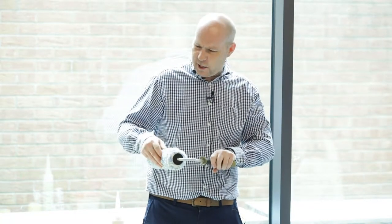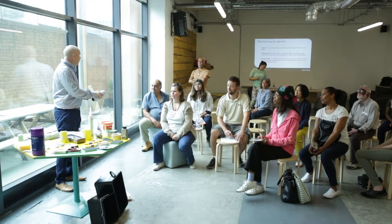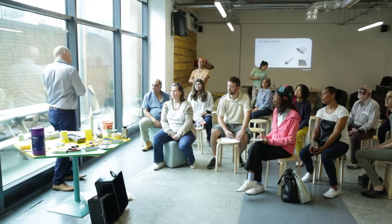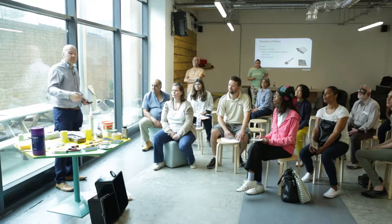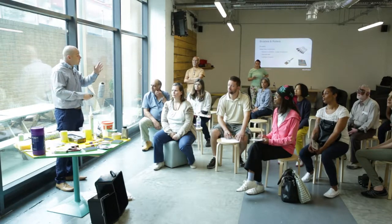Roller. So this is a heavy pile roller, a long pile roller. Long pile versus short pile rollers — a long pile roller is for a rough substrate wall where there's lots of texture and you need to get into the crevices. Generally on emulsion interior walls you'd just use a medium or short pile roller, which gives you a nice finish.